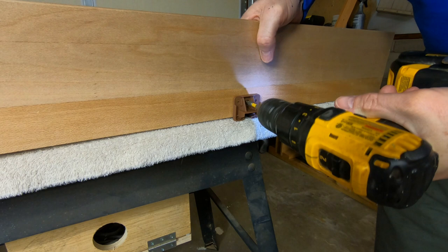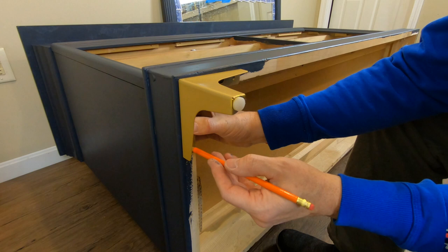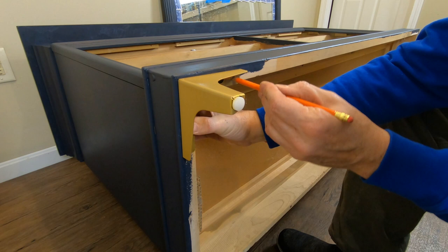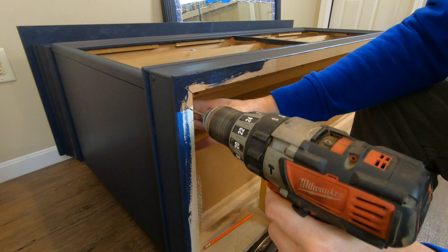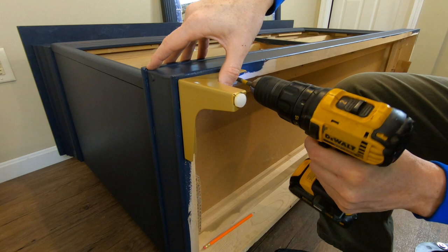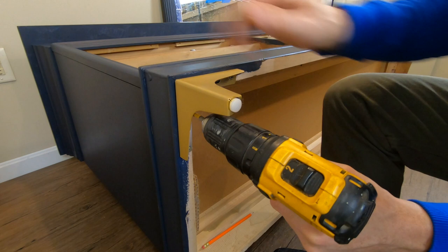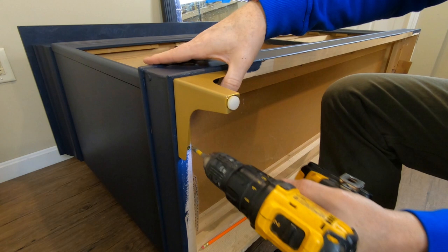It just took me a couple of minutes to add the drawer slides that were broken on these drawers, and then I changed my focus to the legs — and they went on real simple. I marked the holes, and because this is a hardwood maple base, I did pre-drill each of the holes so I don't risk splitting any of the wood. When I'm screwing something on that has multiple screws, I'll put each one in three-quarters of the way but I don't make them tight until I get all the screws started, then I go back and tighten down each of the screws — that way everything lines up just the way that you want it.